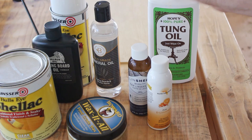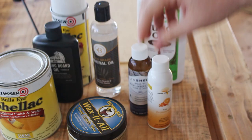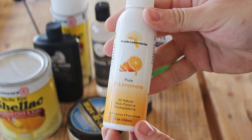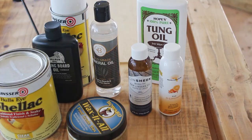Raw linseed — if it's boiled linseed it is not food safe. And tung oil — this stuff is kind of weird in that it's an oil but it seals really well for moisture, and from what I've researched it can stand some heat too. It's a natural finish made from the nuts of the tung tree. And for a bonus we have d-limonene — it's a natural solvent made from orange peels. You can use it to dilute a finish and help it penetrate the wood fibers.